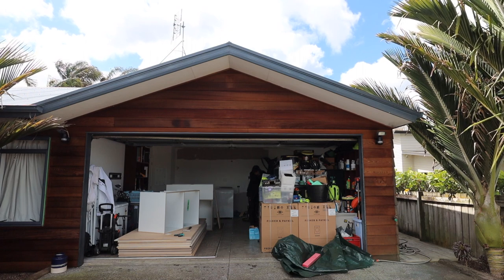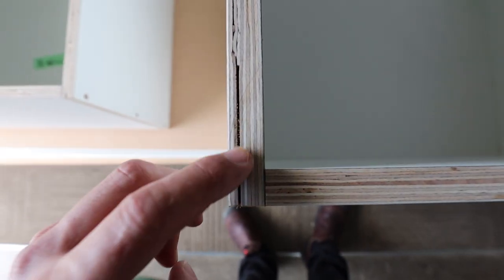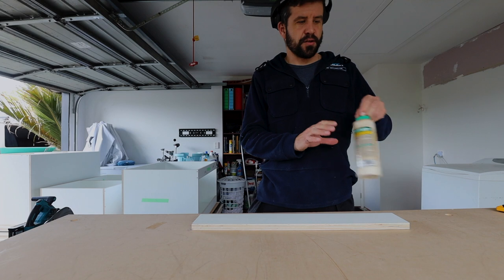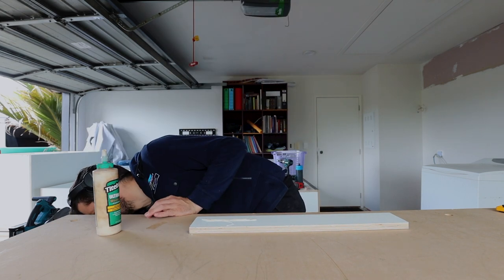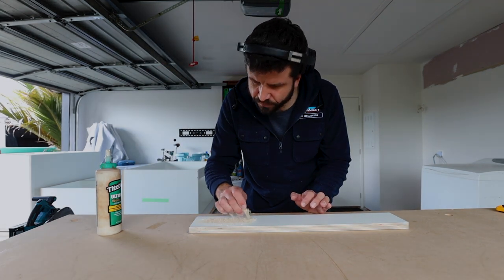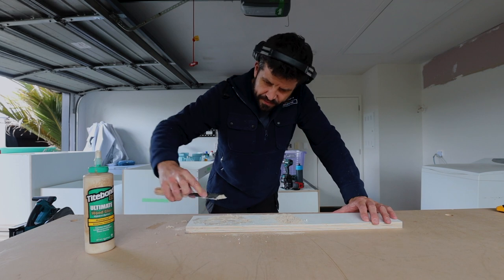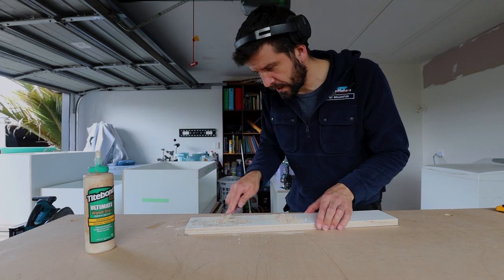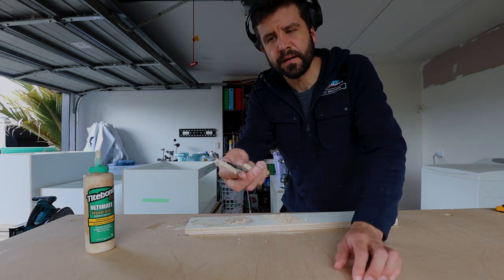I'm going to do one experimental thing, and it has to do with these holes. There are heaps of gaps in the edge of the plywood — some are worse than others, some aren't so bad, but either way we need to fill them. This is one of the oldest tricks in the book: use sawdust and use glue, and get the sawdust straight from the vacuum. It's not perfect because there might be a bit of white in there, but it'll be fine. Sometimes I like to think a builder was doing this one day and that's how they came up with MDF. You want a sort of bog consistency like that.